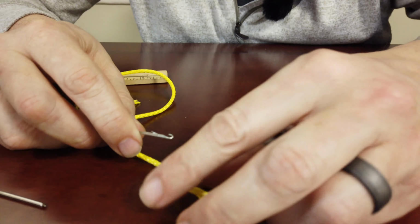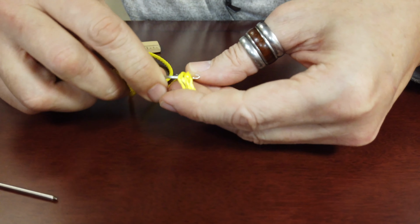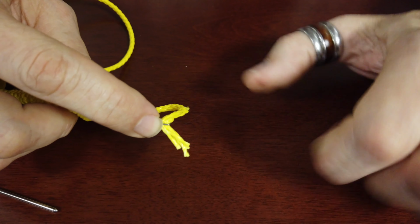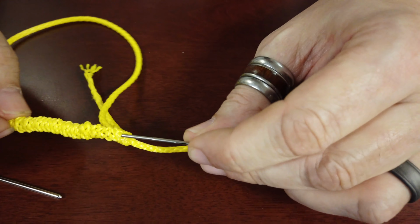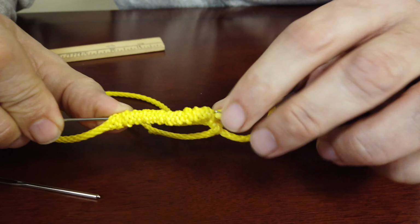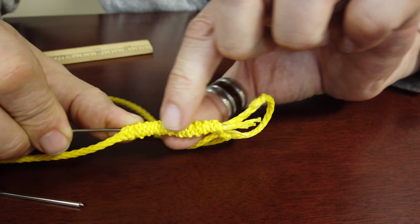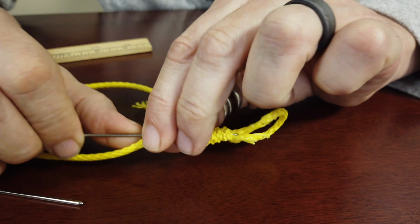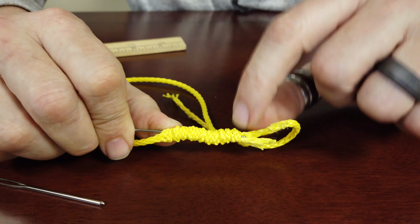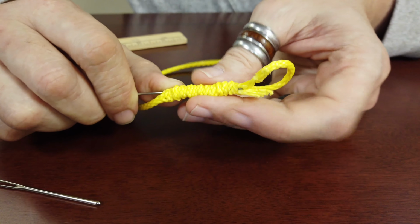So when I put the rope on the loop turner, again, I want to go halfway from the taper to the end, and I lay it across, and I kind of pull the strands in, and then I close the gate. So to hold the gate closed, I push that up there. Now I've made this small again by kind of pulling these strands back, and I've kept this big because I am pushing back on here. So all 3.5 inches, there's probably 4.5 inches of rope, is condensed down to about this 1.5 inch area. This thing is a big tunnel that goes through here, and I have to pull through the rope.